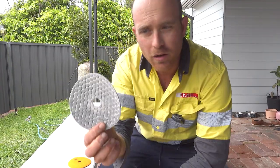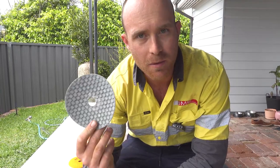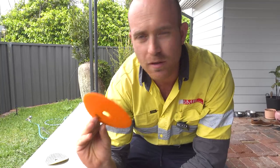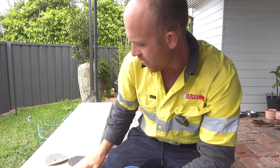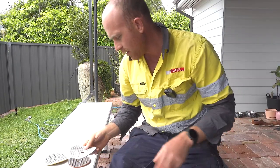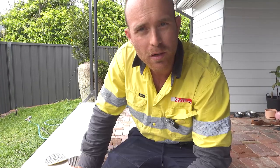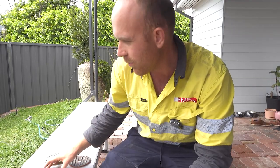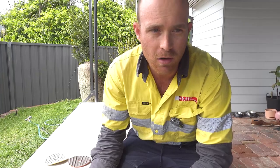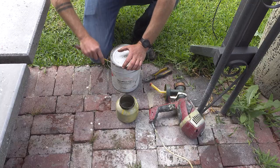We're doing the final honing now. I've already honed it with 50 grit, then done it with 100 grit. There are a couple of imperfections I still need to get out with 100 grit, then I'm going to move on to 200 grit and may finish with 400 grit. You've got to be careful — if you go too smooth the sealer won't stick. A tip: with your roughest grit, in this case 50 grit, don't stop honing until you've got out all the scratches and imperfections. Don't think that stepping down to 100 grit will get the remaining scratches out — often it doesn't and you end up having to go back to the start.